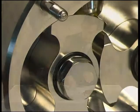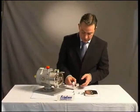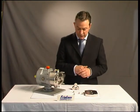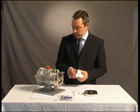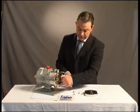Also, the timing of a bi-wing is much easier. Tri-lobes have an inherent problem when they're maintained and put back together — the timing is incorrect and the rotors contact each other and wear much more severely, so the pumps tend to last a lot less longer.